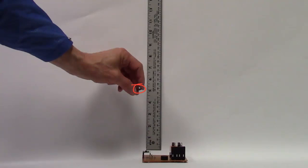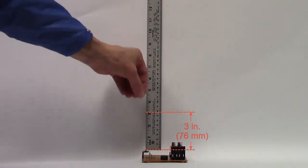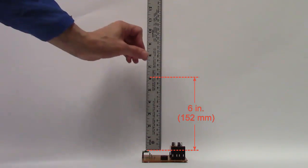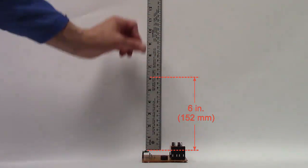Here's a small inexpensive ceramic magnet — the sensor works about three or four inches away. A larger rare earth magnet activates the sensor about six inches away. And here's a magnet from a microwave oven magnetron; we can detect it about twenty inches away.